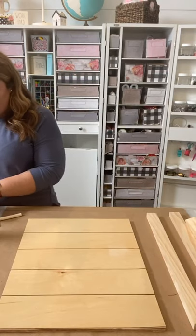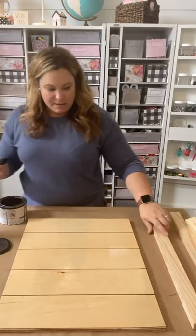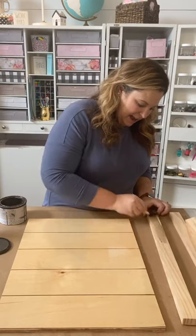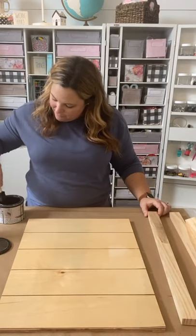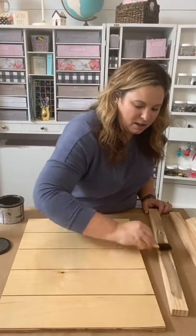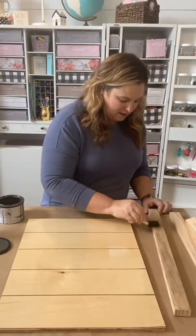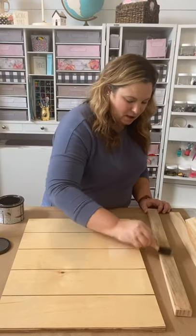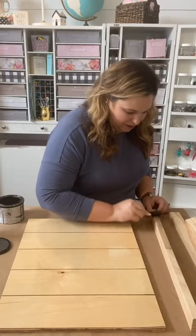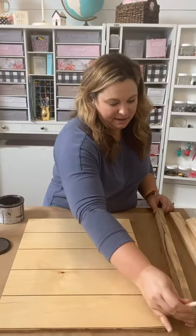You guys know that one of the first things I do to any project is stain the trim. I'm going to stain the trim now with you guys so you can see it. This is the trim that's going to be added to the sign — I always do it first to just have it done and out of the way. I'm getting to the end of my favorite stain of choice, which is called Old Barn Living, and this is the color called Weather. It's kind of like a milk-based stain, and I just love this color. I use it all throughout my house and it coordinates all of the pieces together. If you are getting into stained wood projects like this, I totally recommend you stain things similar colors, if not the same stain.